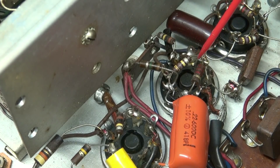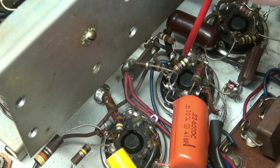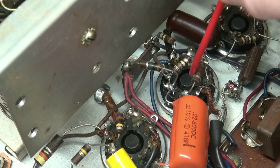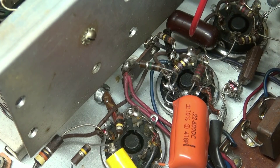This is V11, the first audio amplifier. You can hear my noise — once again, I cannot turn it down with the AF gain. It's just noise on the receiver. Watch how sensitive it is in this area. You can see about everything I touched down here is reacting, especially this one meg resistor. Very sensitive.